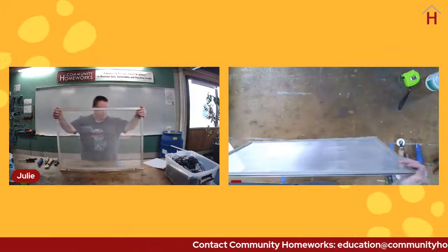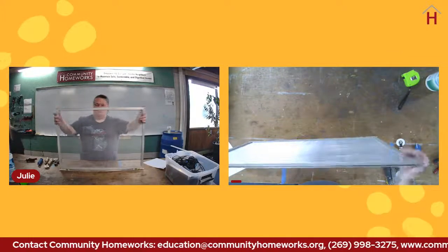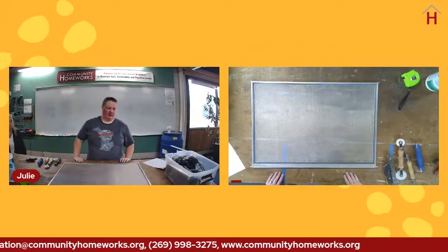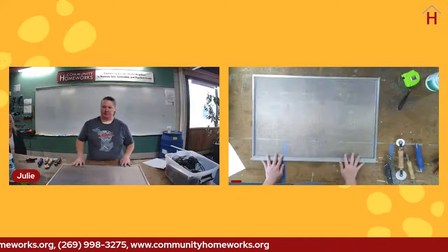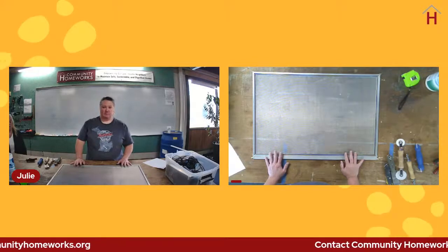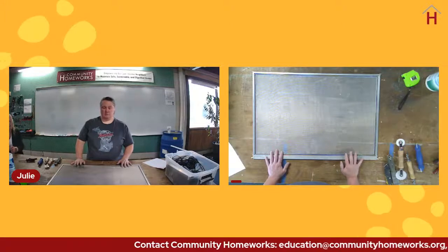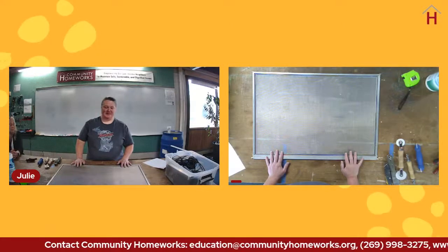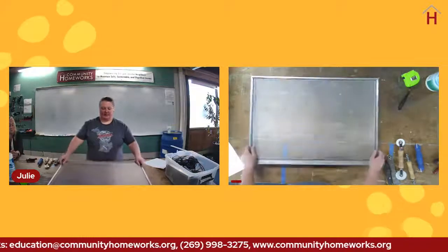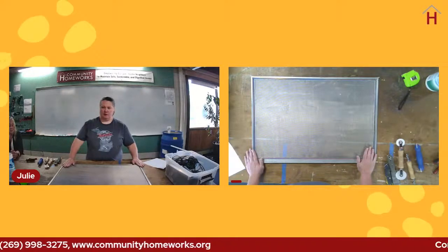If it is, shake it back and forth a little bit like this, and it will usually loosen the screen up just a little bit, and that will usually overcome whatever out of squareness you have so that you can get it into your window. And remembering that old houses, quite often, nothing is square either. So don't work on getting it real square until you find out it doesn't fit. Sure, yeah. Try to put it in before you spend too much time worrying about whether or not it's going to go back in. And yeah, so hopefully this works for you when you try it at home.